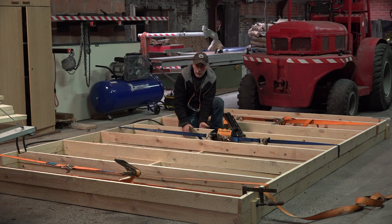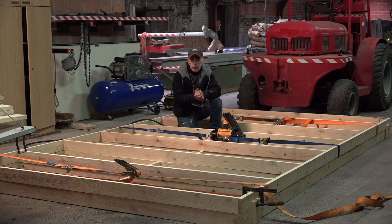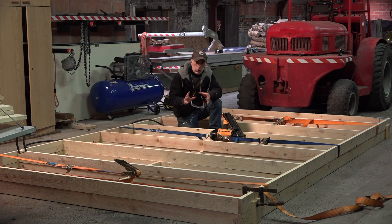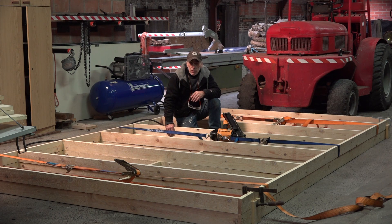I've built the first frame and nailed it all together, so now I'm going to build the second frame — this will be the left side and the right side of the spray booth. I use just ordinary wood as you've seen, but you could use any kind of material depending on what's available. You can use metal studs like those used for drywall, or instead of wooden boards you could use drywall itself. Whatever is most economical — you can bolt, screw, or nail the frame together, as long as you have a solid frame.